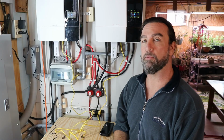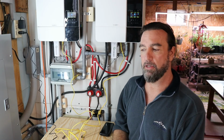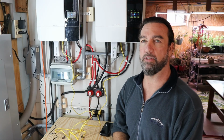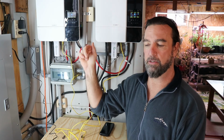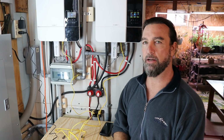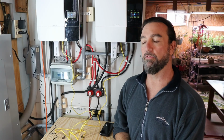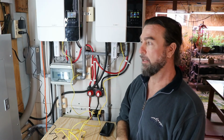Sure, it's a cool little option, but when you're dealing with the energy, you're dealing with the batteries, you're dealing with lithium, it's nice to know an exact percentage. I mean, yeah, it would be nice to be able to take advantage of the feature of the electronics and software in the inverters actually communicating with the electronics and the software in the BMS. That's not happening on lithium with this 3000 TL LVM-ES and the EG4-LL 24 volt batteries. Maybe there's a certain level of communication going on, but not all of it.